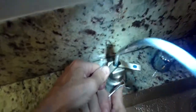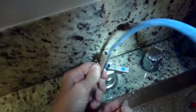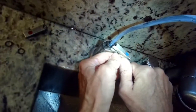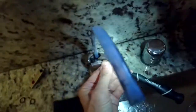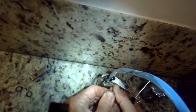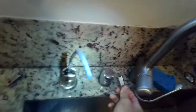Looking at the directions that come with the kit, what we have to do next is take out a little pin and then push — this is the hot side — push this forward toward the plastic tube by about a quarter of an inch and we can lift it off. You have to take out that little pin; you can actually use the allen wrench, it's just the right size to push that pin out. On the plastic model there is no pin holding the arm — you can just push the lever in toward the plastic faucet tube by about a quarter inch and lift it off. On the metal one you've got to pop out those little pins, push it in, and pull it off.